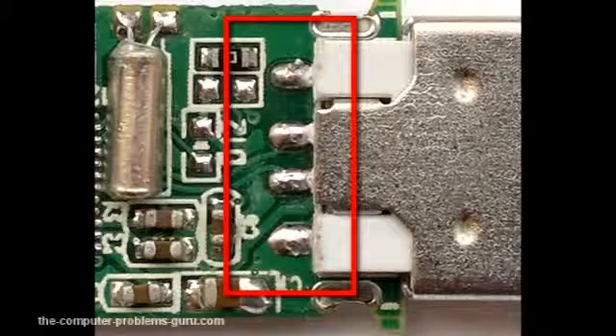This is shown here. The plug is almost always soldered onto the PCB without using glue, which does not provide for a sturdy connection. When the USB stick is carried around for a long time, it forces the joint to eventually break due to constant bending. The simple solution here is to open up the stick and solder the four pins again.